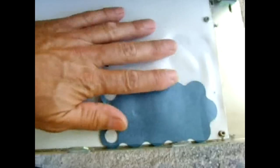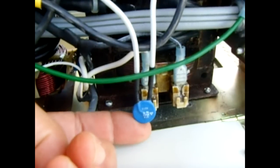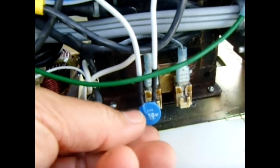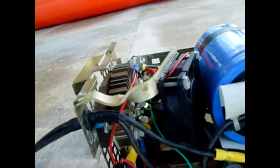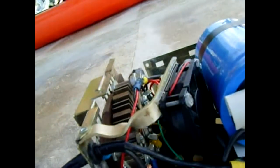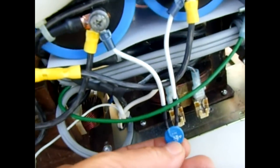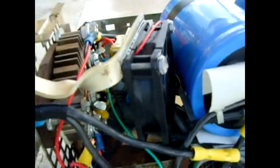I covered the bus bar to protect it from shorting on the cover, and I also put protective material on the cover itself. This component is a varistor — basically, as the voltage gets higher, the resistance gets lower. You want it rated a little lower than the voltage of the capacitors or diodes, so if there are any voltage spikes, the varistor absorbs it first and gets ruined before the diodes or capacitors do. My diodes are rated around 100 volts and the capacitors are 80 volts.